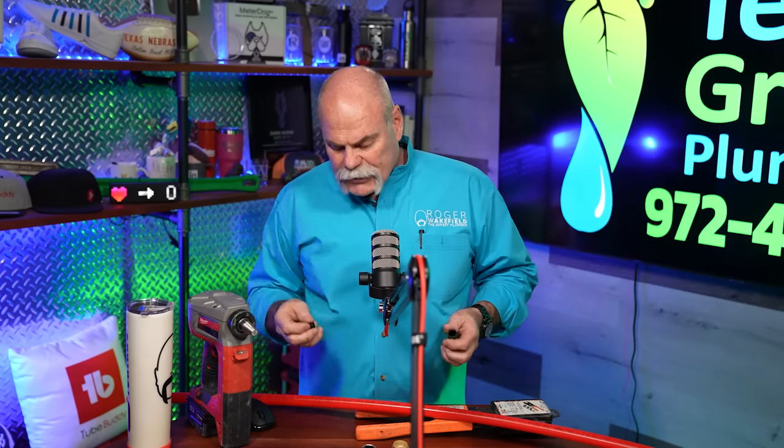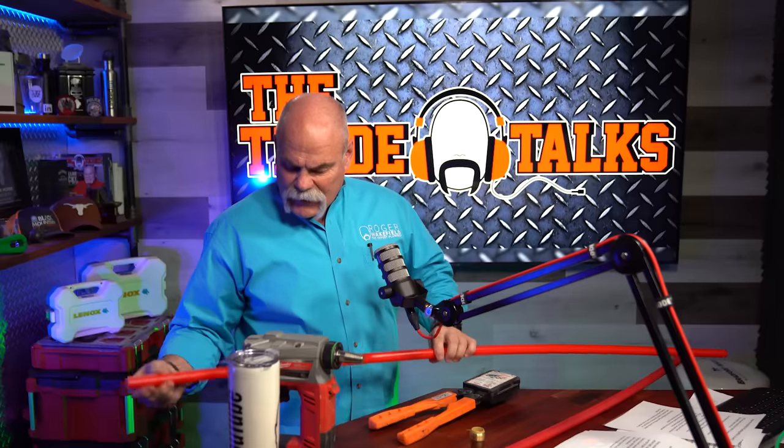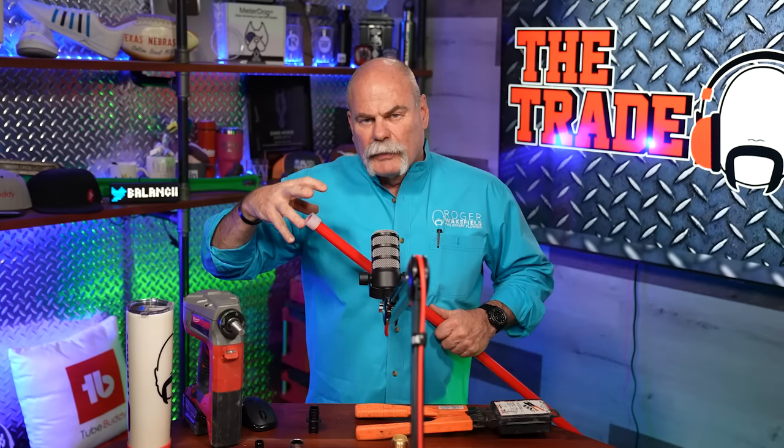The first thing I'm going to show you how to put together is PEX-A. The push-together or clamp type will work with A, B, and C. What I prefer — what I like the most — is the A type, the expansion type. You take the pipe, put a ring on the end of it, and slide it in. That fitting won't slide in there right away, but you have an expansion tool that will expand the pipe out so you can slide the fitting in and lock it down. And if you expand it and then forget to put it together, it's going to go back to its normal size and you just expand it again.